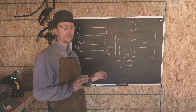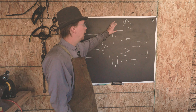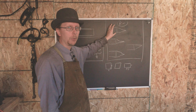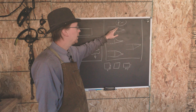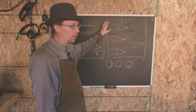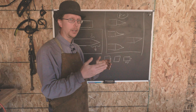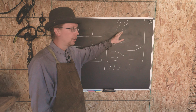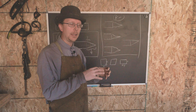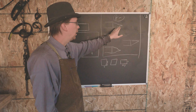There are a couple areas that things can go wrong, and this is really what this exercise is all about. You can wind up with any of these things in the F minus category as opposed to the A plus category. The first one: if you don't have smooth hammer blows, you can get a bump between each blow. This can come from a hammer that isn't well dressed with sharp edges, leaving lines as you draw out. If you're working only at a very hot heat, you'll tend to get a wavy pattern. A great way to correct this is to continue working the bar as it cools down — it gets harder to move, you're moving just the surface, making smaller movements, and you can clean this up and get it nice and level.